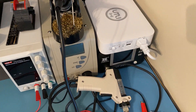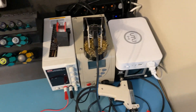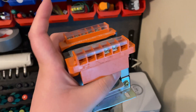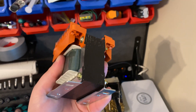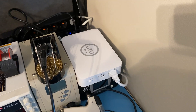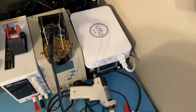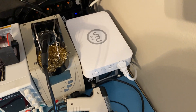Here is the new transformer I bought for the soldering iron and desoldering station — this white box labeled UMI. It's compact. Normally with a transformer you're talking about an EI transformer — typically large. Inside the UMI you find a toroidal transformer, which makes it more compact. Toroidal transformers are preferred in audio applications and don't have that annoying hum that my soldering station's EI transformer produces. The UMI also has multiple protections: a fuse on the input side and another inline fuse inside.